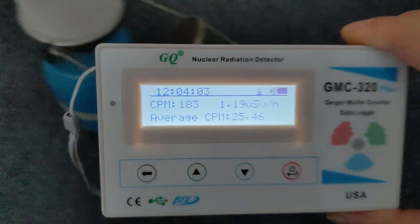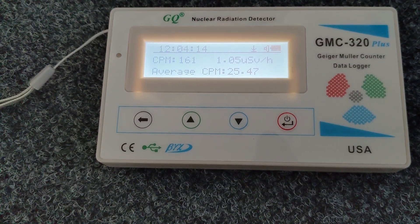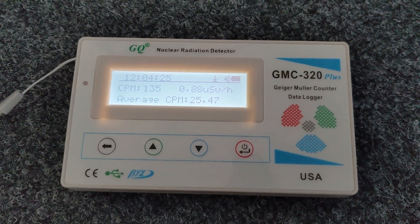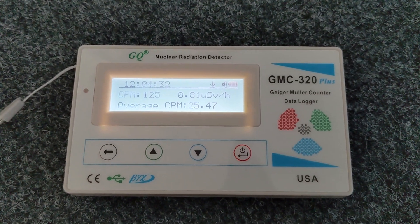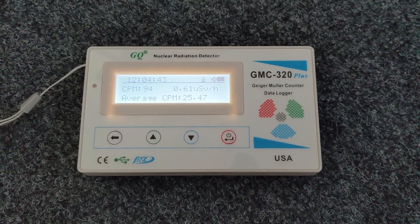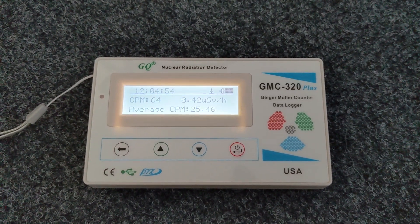I think if you really want to know what's going on, you want to get a scintillator and not a simple Geiger counter. A Geiger counter basically tells you: yes, something is detected, my tube's counts per minute rises — but what it is, you don't really know. The microsievert per hour shown are 90% of the time completely arbitrary; it only means something if you know exactly what kind of radiation it is and it was calibrated for that. A scintillator tells you what kind of radioactive elements the radiation is from.